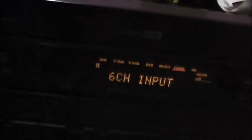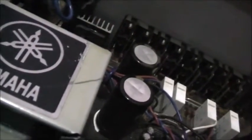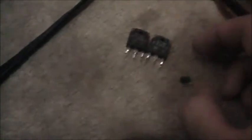Right, input source. So these are in the video circuitry, the video processing part in here. Keep the hand on here. Not so warm now. So the amplifier is okay, it's just this part of the circuit board I've got to fix. I'll test these now. Get the multimeter out and we'll check these transistors.